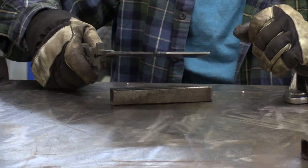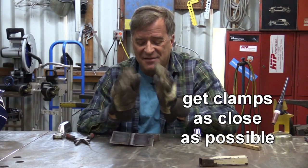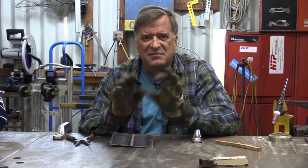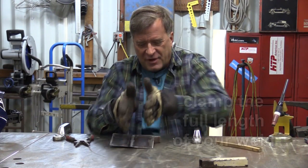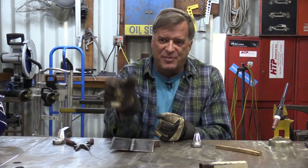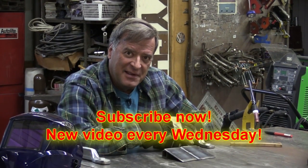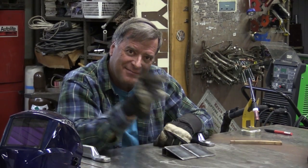So what do you think? That turned out pretty good actually. There's one little trick for you — to keep things from warping, get your clamps as close as you can, get a piece of metal on there, something big and heavy, leave enough room to weld it, but run the whole length of your weld. If you can get everything clamped down — even going clean across your bench with a piece of solid stock, one-inch square or something — clamped on both sides, everything held down as firmly as possible. I hope that points you in the right direction. Go ahead and hit that subscribe button, and we'll see you next time.